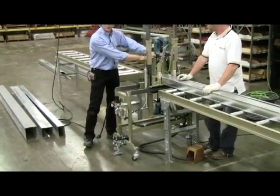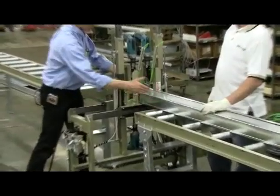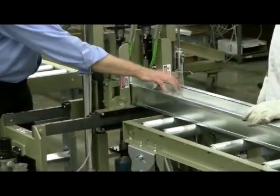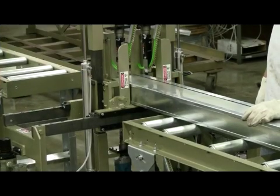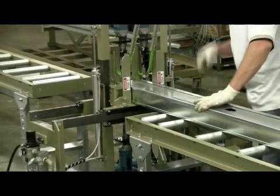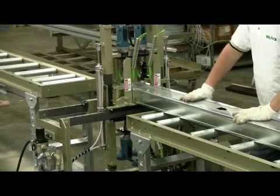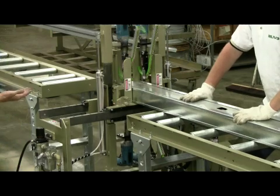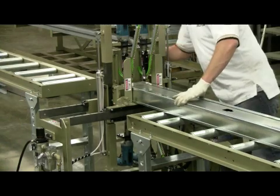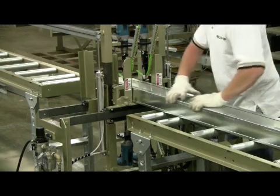Once again, you've got a series of stops on the back side, which is what we've got set up here. So the material comes up, the mandrel's inside here, guys, all right? Everything's being held. You've got your screws, go ahead and fire it off, sir. He's running, we're stroking from the top, and we're also coming in from the bottom. He moves the stops out of the way. There's a stop on the right and left-hand side.